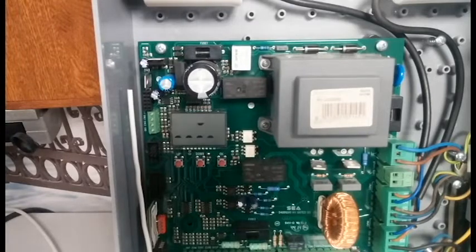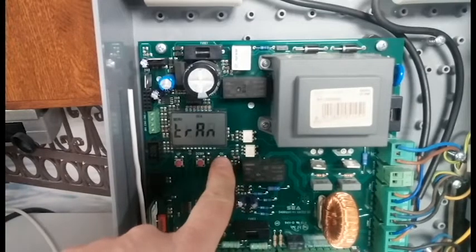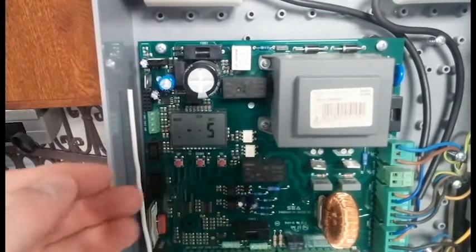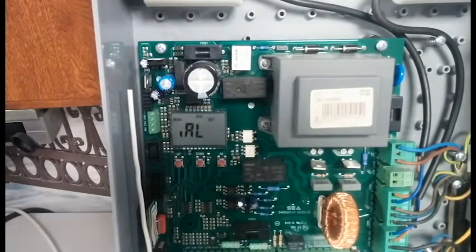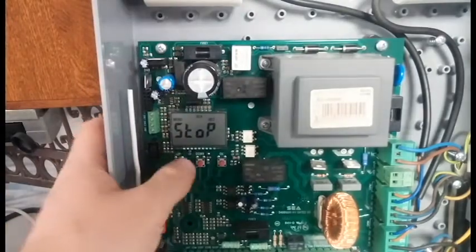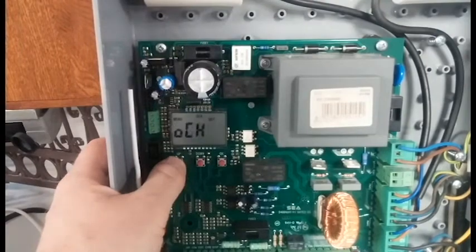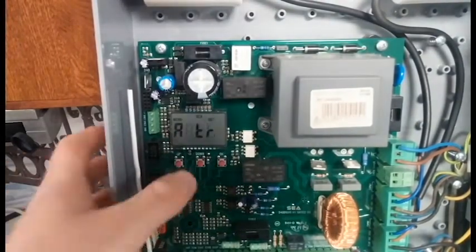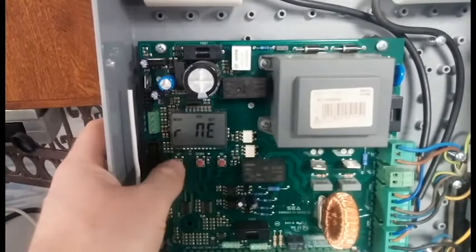With the power back on and the dashes on the screen, press the up button until you get to number two — Transmitter — and press OK. Start will be the first option on the menu. Other important options include partial start or pedestrian start, external module, stop, unlock, delete transmitter, and clear memory. That last one is quite important to remember — I'll explain why later.